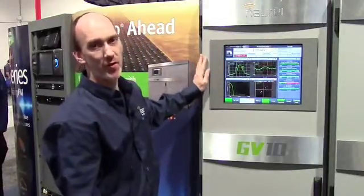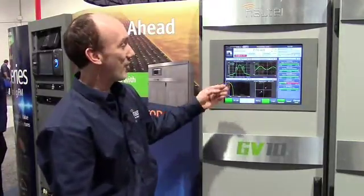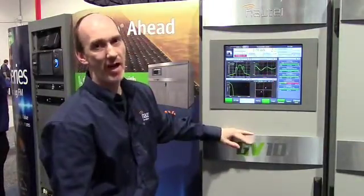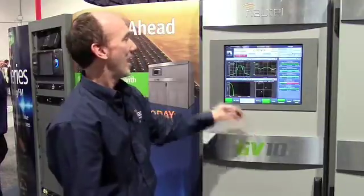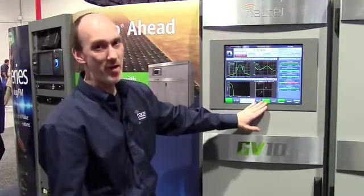The user interface is very similar to the previous NV family, but now with expanded capabilities and functionalities, including a real-time oscilloscope. With this, we can track the HD correction curves and the audio inputs, including MPX left and right. As always, we have a spectrum analyzer included, and MER metering.